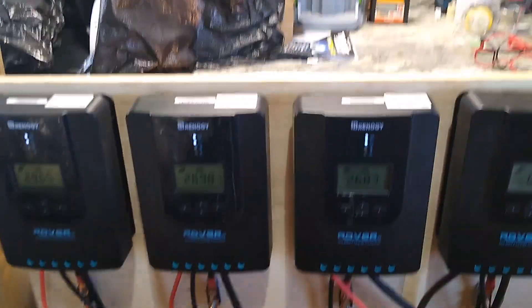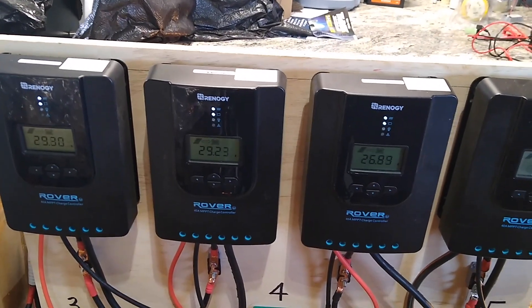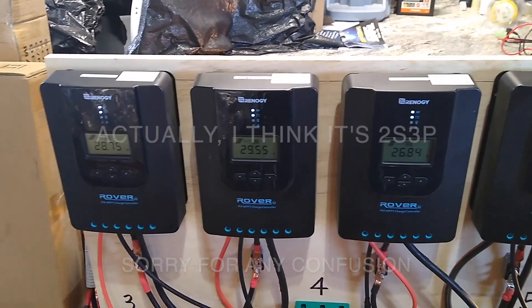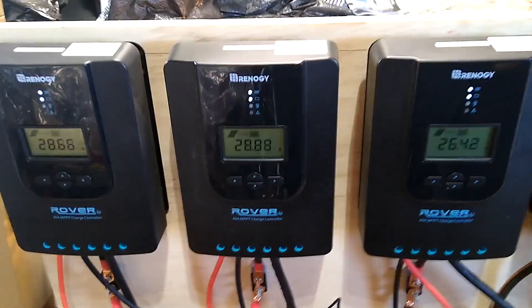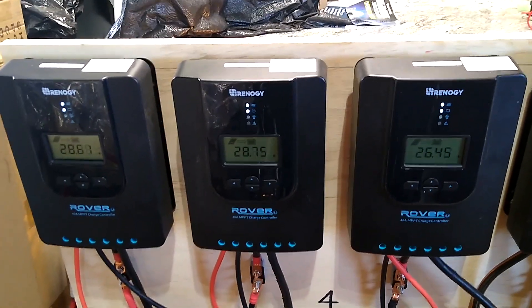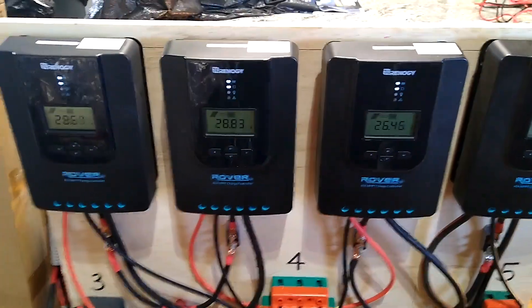Normally I use the hybrid scheme: three pairs in series on each array, then those wired in parallel — that's 3S2P, three series two parallel. And what we see here is that this produces the highest output, more than the series one, not by much but a little. So for those of you telling me I'm losing efficiency by having them in parallel — you were jumping to a conclusion. They weren't in parallel; they were in the hybrid series-parallel, which in this case seems to be the best way to do it. Series or parallel for this system — not much difference.